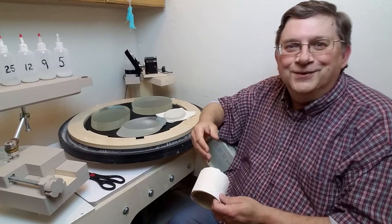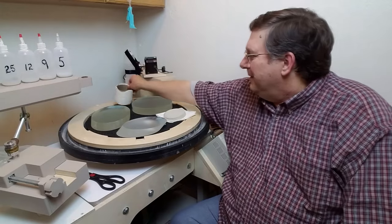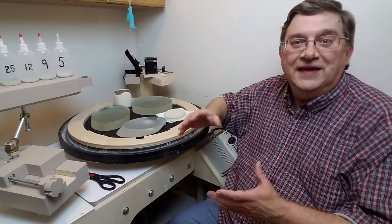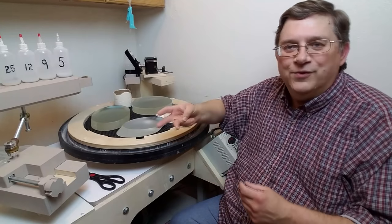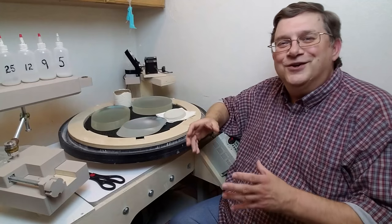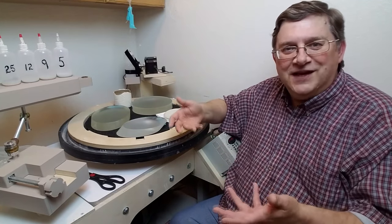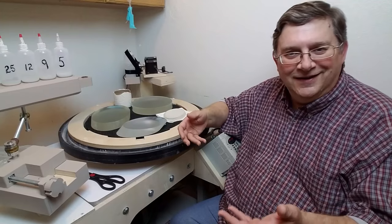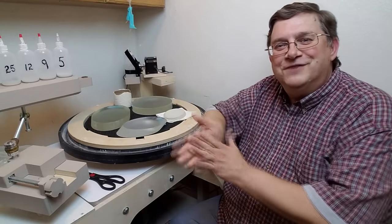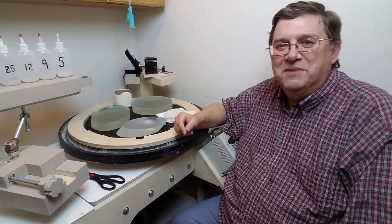To facilitate this, you need a flat tool to stick the pads on. When grinding flat mirrors, a lot of times you use the ABC method: take three mirrors and name them A, B, and C, then grind A on B, B on C, and C on A. Then flip those stacks over and grind A on C, C on B, and B on A. Anytime you do three surfaces like that, they all come out flat — that's what the geometry demands.